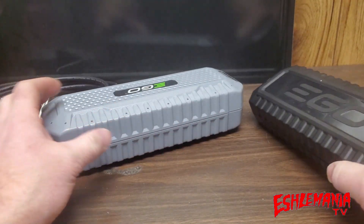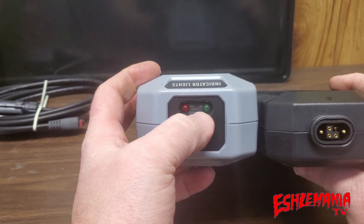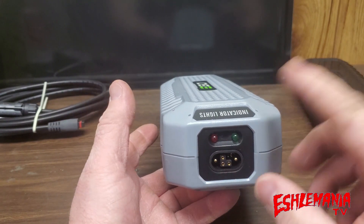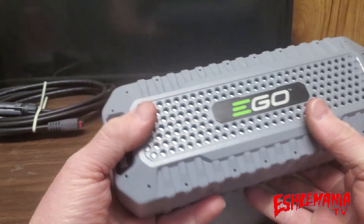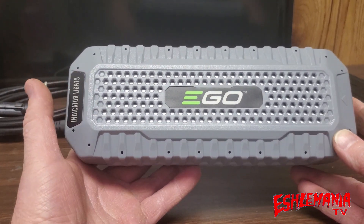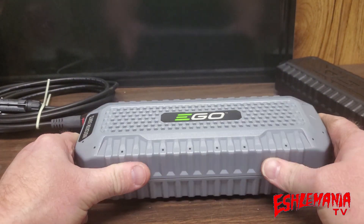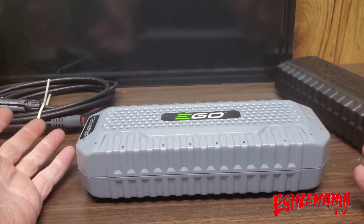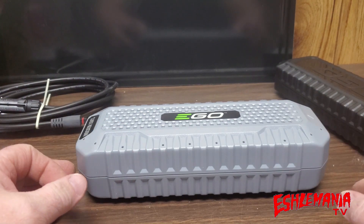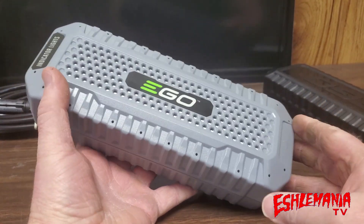On the end that plugs into the power station, this one has red and green LEDs to indicate whether you're at full charge or if it's not charging. What this adapter is really doing is taking the place of a charge controller that you'd find in a regular solar panel setup — so you won't need a separate charge controller. You just plug this directly into the solar panels and the other end directly into your power station. It will charge your Nexus power station batteries, but you cannot use the power station to power devices while it's charging — there is no pass-through technology. Pass-through would need to be in the power station itself, and the power station does not have that.